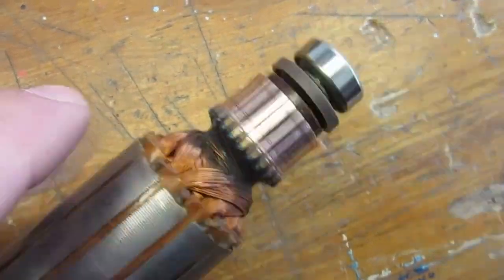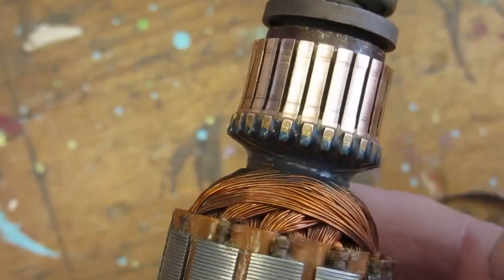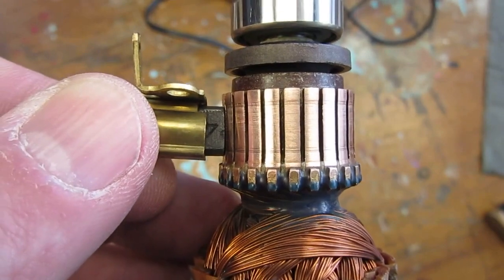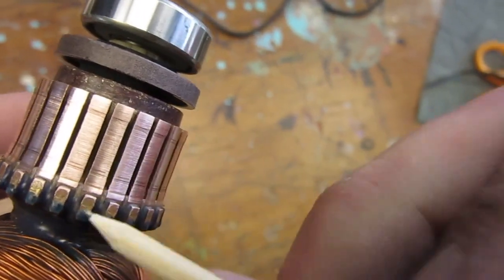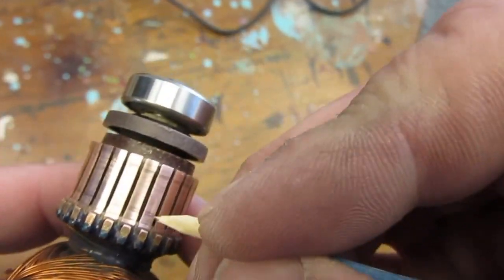There are still at this stage a few grooves left, but I'm happy to stop here to limit the chances of altering the commutator symmetry. The grooves left are after all only making contact with the outside edge of the brushes, so we should be fine. The next step is to clean the mica between the slots of any debris and dust, confirming also that they are still at their recommended height.